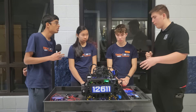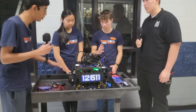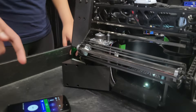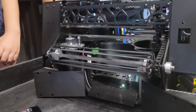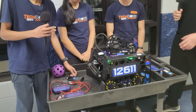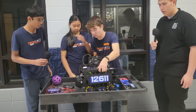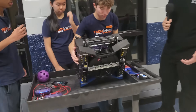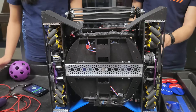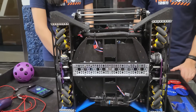And what kind of sensors are you using on the spindexer? I think I see a few color sensors down there. Yes, we do have a few color sensors — we have four in total, two on each side. So we detect it when it comes in, it shows the color, it registers it, and then it turns automatically. What other sensors do you have on the robot? We do have odometry as well on the bottom. We have pinpoint, and then we also merge these values with our limelight localization, which is full 3D tracking.